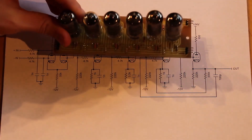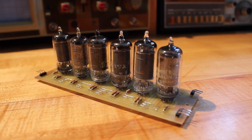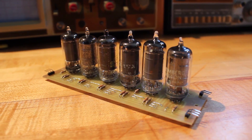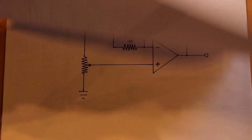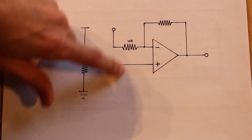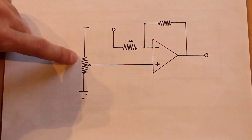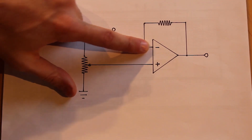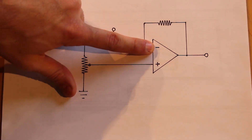And here is the result. Now that we've got it built up on a circuit board, I want to test it. We're going to do that by using the same negative feedback design we used in the previous episode. The operational amplifier is set up with the non-inverting input going to a potentiometer to adjust our DC offset, and a 10,000 ohm input into the inverting input.